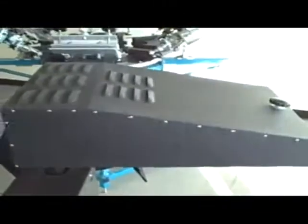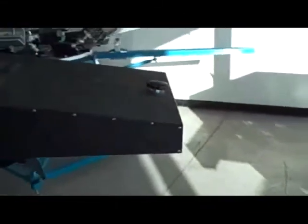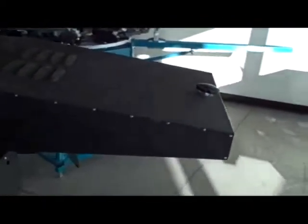The second reason for this aerodynamic shape is that we want to be able to clear the screen. When you have a screen on your printing press, being tapered down at the front allows you to clear the screens much more easily.